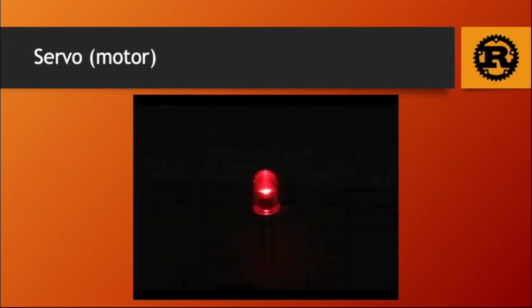I will now tell you about the servo motors, but also the timers, which are very important in this kind of project. I will, of course, show you what I mean with an animation at the end of this slide. So the servo motor is a simple rotating motor, but we do not need it to go all the way to obtain the rotation. So we can think of it as a light dimmer. We will use something called pulse width modulation.